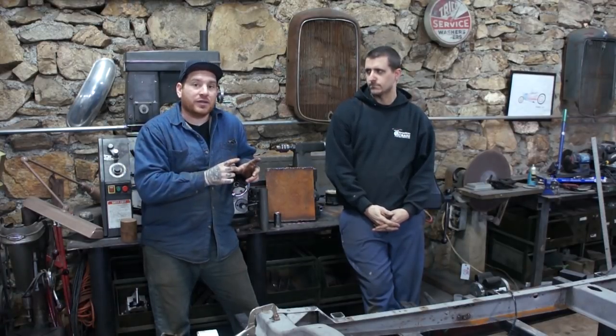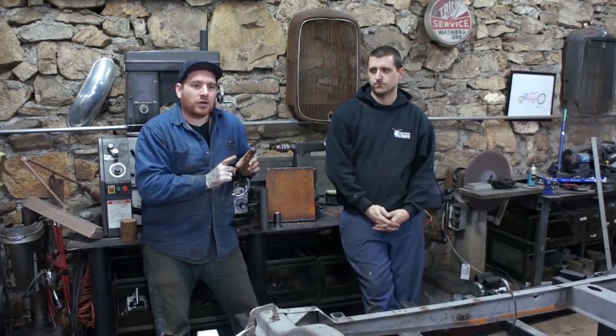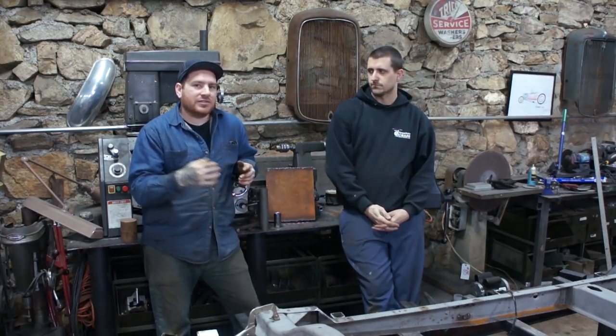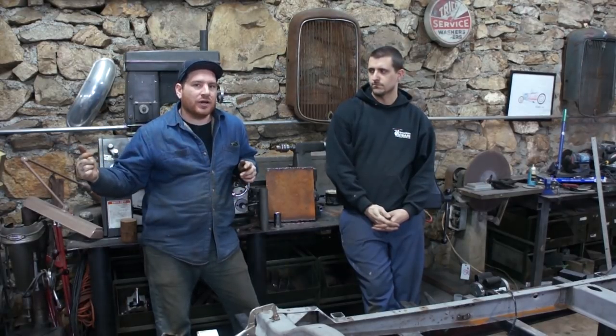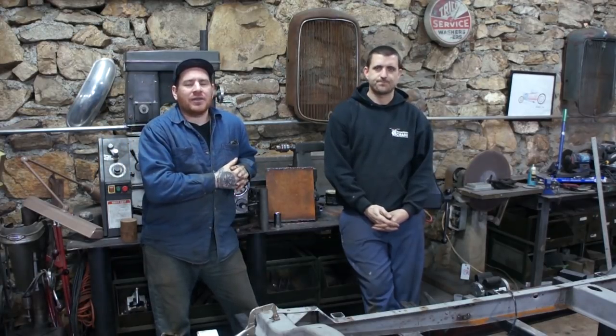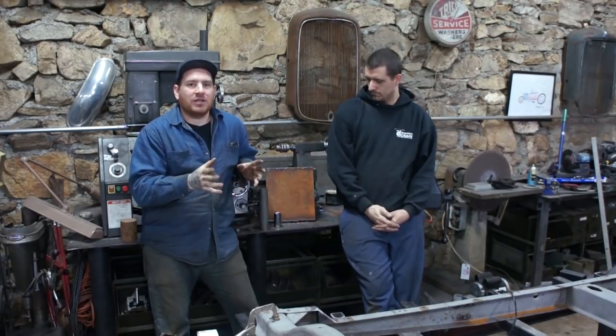It's not quite long enough because we're using a box from an F1 pickup. The sector shaft is short, and the pitman arm ends up being basically inside the cowl. I've seen some guys that run it inside the cowl, and then they just put the drag link through the body. It looks okay, but I'd like to put the actual pitman arm outside of the body, so we need to make an extension.